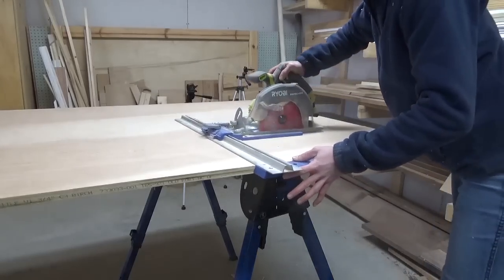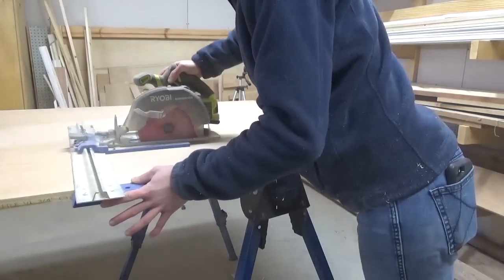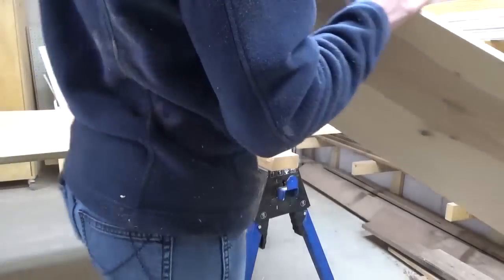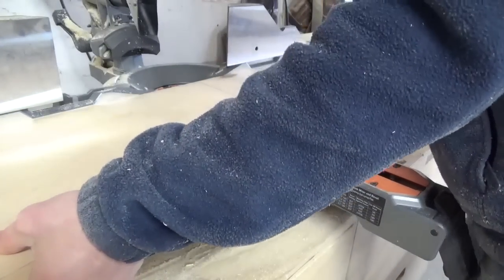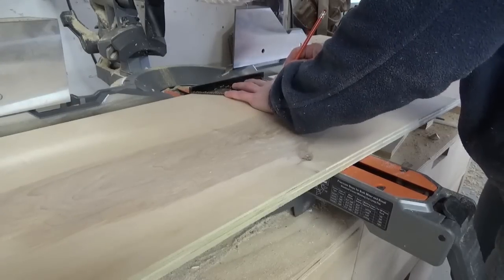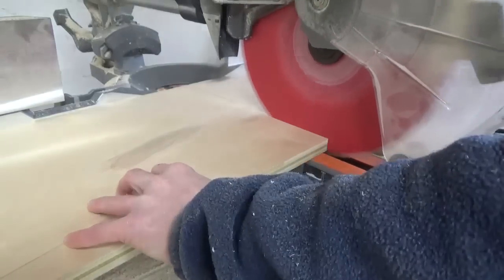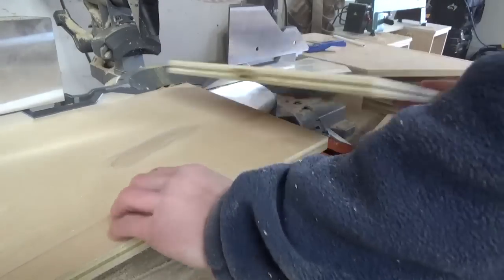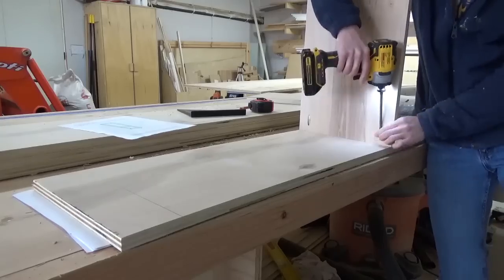This project used three and a half sheets of three-quarter-inch plywood. The first thing I did was cut these down to manageable pieces so that I could more quickly assemble everything. I provided a link to the plans with a plywood cut diagram in the description below, and also in the blog post linked below. Once I had my plywood ripped down, I trimmed these pieces to length to start assembling the two tall skinny side cabinets. In order to move it from my shop to my parents' house, I built this in three sections — two smaller side cabinets and one large center cabinet. I assembled the cabinet carcasses using three-quarter-inch pocket holes and one-and-a-quarter-inch pocket hole screws.